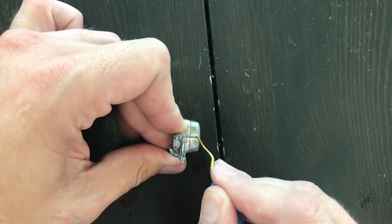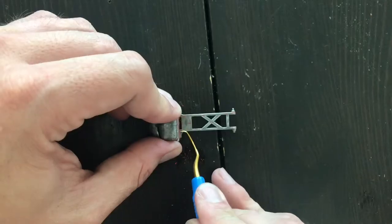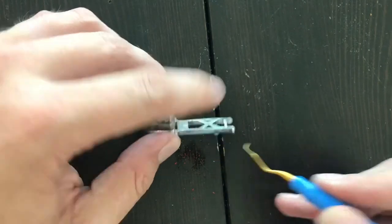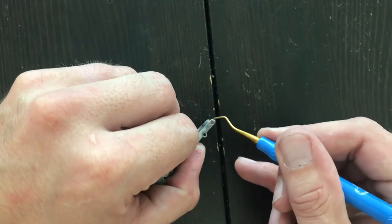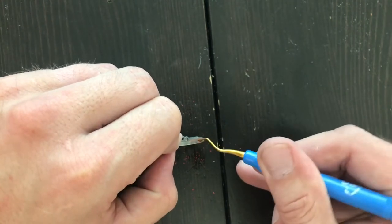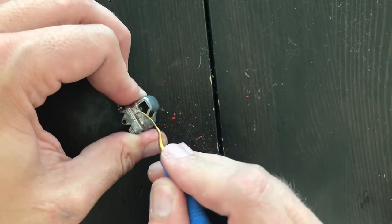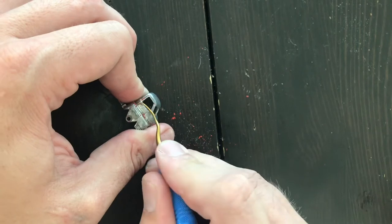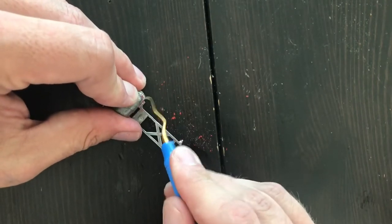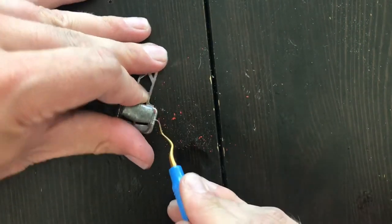On the little tipper truck, we're now after three different rounds of stripper. I'm down to just a few little areas where the paint is really stuck in some of these little niches and crannies. To remove that, I'm just using one of my little dental pick tools — one I got from my dentist that was no longer being used on teeth. These seem to work really well to get in there. I do want to be careful because this is a much harder material that can scratch the casting and it's possible to damage it or remove some of the details or body lines. I just want to get rid of all of the residual paint.